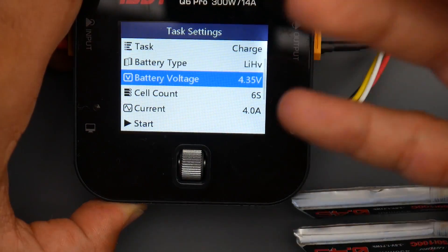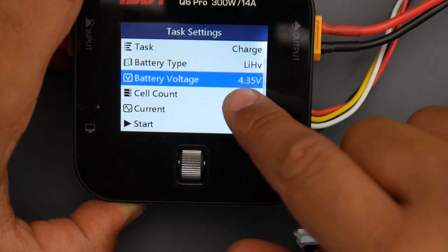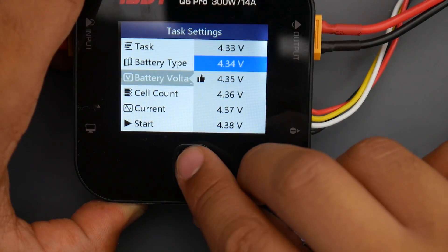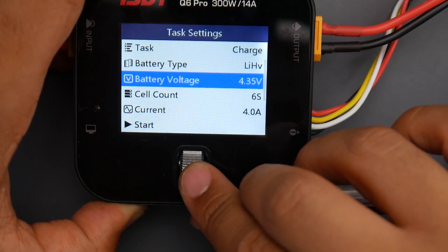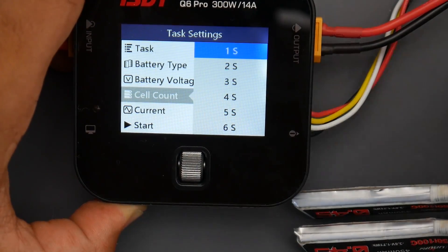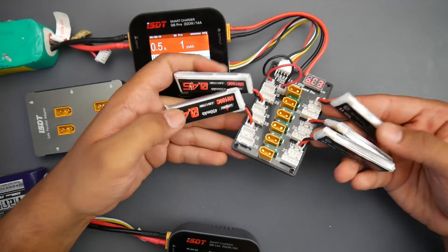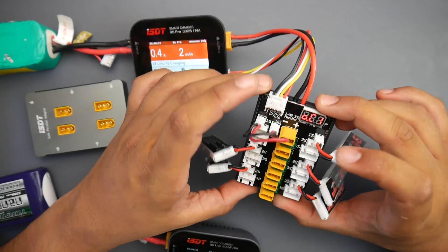Battery voltage is also a cool feature, allowing you to set your final battery voltage. The preset for HiVolt is 4.35, which is a full battery. You can slightly overcharge or undercharge, but only do that if you know what you're doing — otherwise, just keep everything default. Cell count is very important: for example, if you're charging a 1S LiPo, set it to 1S and then set the current as you please. Right now I'm charging my 1S HVs on this board, and I'll have a link to this down below.